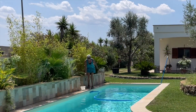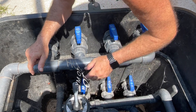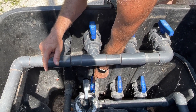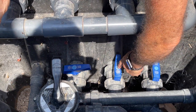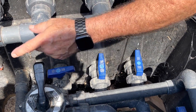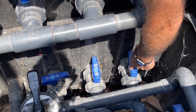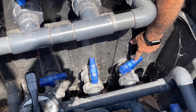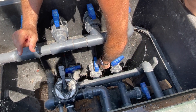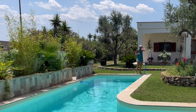I've got it in the hole now. This valve here is the bottom drain — you close that completely. This valve here is the weir closest to us, and this valve here is the weir closest to the brine, so you close that one not all the way but about halfway. Then you vacuum in through this closest weir. We should be good to go now.